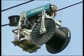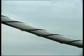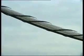The cable is lashed to the bottom of the ground or phase wire. The spinner wraps a special lashing tape around the ground wire and the fiber optic cable. Ground wire clamps are used to fasten them to the masts at each end.